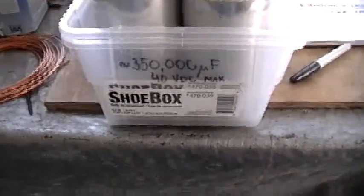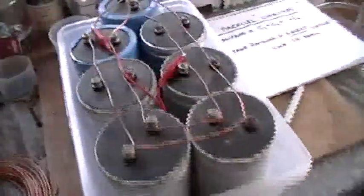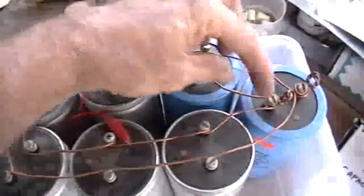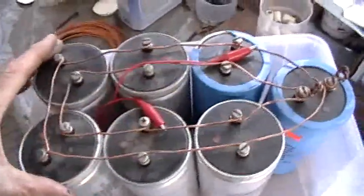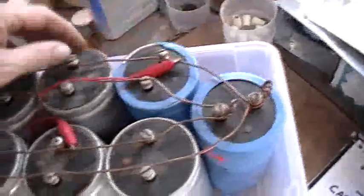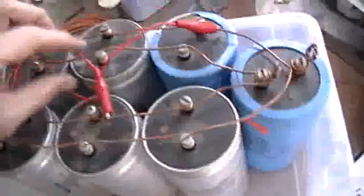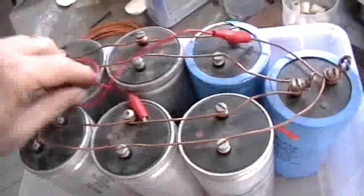There's been some question about the capacity and voltage handling ability of this capacitor stack that I used in the experiment where I showed Tar Baby running exclusively on this capacitor bank with no batteries at all. You will note that the capacitors are wired strictly in parallel. Every positive terminal and every negative terminal are hooked together, and we have output lugs right here. I have a jumper shorting the positive and negative loops so the bank stays discharged, because a capacitor bank of this capacity is a dangerous thing.